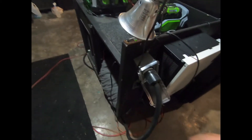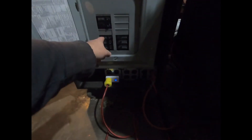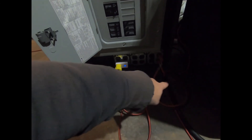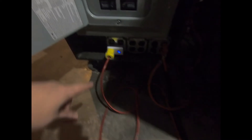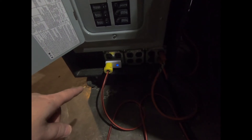I've added 240V output coming off the inverter via a big cable that runs over to this panel box. The refrigerators and freezers are connected to it. It's a panel box on wheels with a 25-foot cable, so I can roll it out if I need to temporarily use power somewhere else within that range.